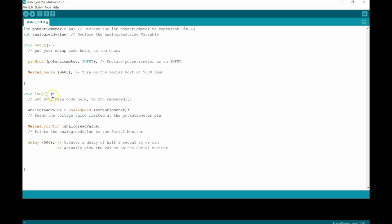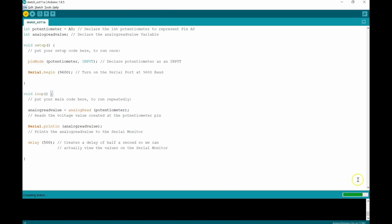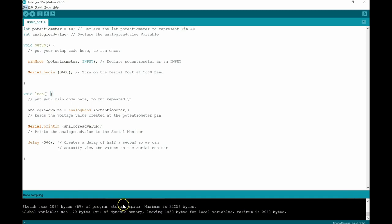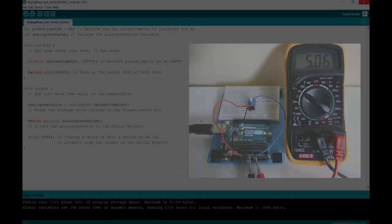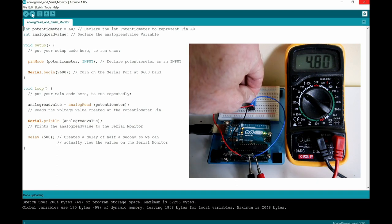When I hover here, it shows the closed parentheses, so everything looks good. The next step is to verify everything we've just done. You can save it in your file folder. It's just verifying below — looks good. Let's download this to our Arduino now. It's now on our Arduino. You can see the 5 volts available right there, and as I change that potentiometer, that voltage should change. As I reduce the potentiometer down, you'll see it go from 5 volts down to 0 volts.